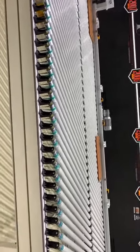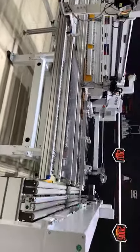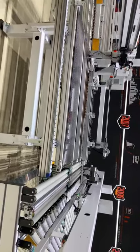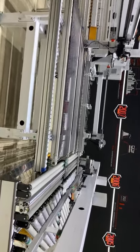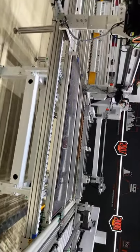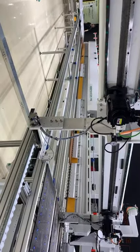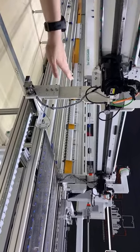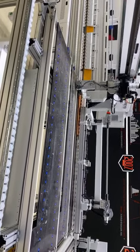The second part of the conveyor table uses inclined rollers to guide the workpiece against the right side fence. Here is also a measurement device to measure the fitting length of the workpiece, then it sends information to the side alignment device so the side alignment device can move to the right position to stand by and perform side alignment. In front of the second edge bander is the feeding system to help the workpiece enter the edge bander smoothly.